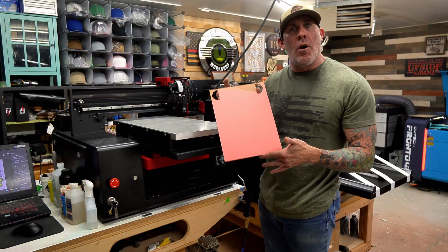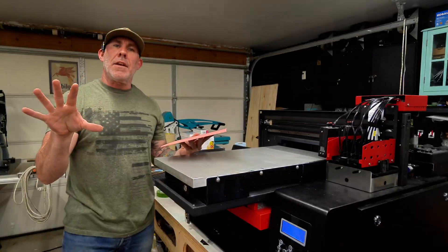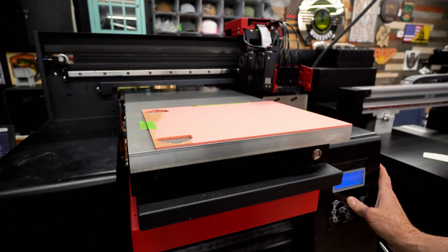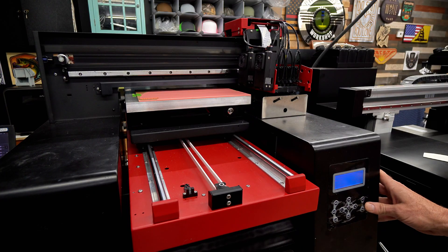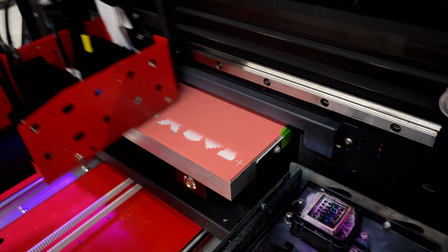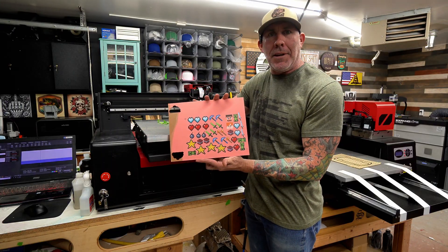Now for this part of the project, we'll be switching over to some acrylic and the UV printer. We're just using some scrap colors — an eighth-inch sheet of like a rose or coral-colored acrylic. Just like with the Baltic birch, our process is the same: square the eighth-inch acrylic on the front of the bed, activate that vacuum table, feed the material under the autofocus sensor, and raise that bed up until it clicks. And again, fresh off the UV printer — perfect print, fully cured and dry, ready to be cut on the laser.